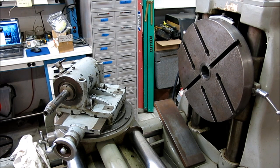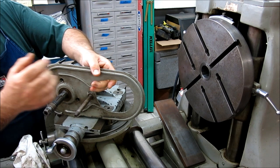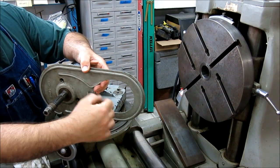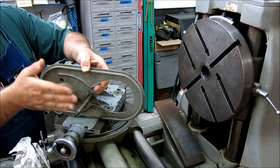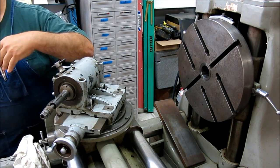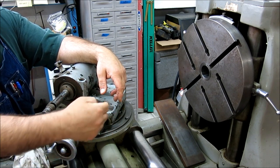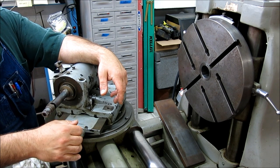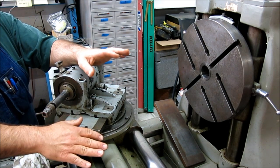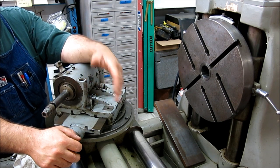This is the stock motor mounting plate, and it went on like so. There was a motor that mounted on the opposite side, with a pulley projecting into this area, and a bunch of step pulleys to change speeds. I don't have the stock motor — all I have is the stock mount. But what I do have is a C-face motor and a variable frequency drive. We're going to mount that motor here with a single pulley and a VFD so we can power this spindle and adjust the speed on the fly.